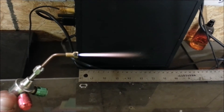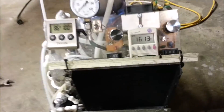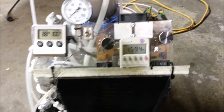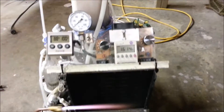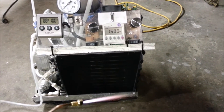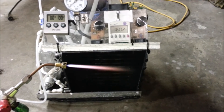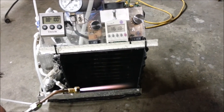We're at 15 amps and I've got a really nice turbo flame going here. For those keeping track of the numbers — I keep calling it amps because that's how I know I'm about to blow my fuse — that's 1,600 watts. This is the flame I'm getting, which is far different from the typical 2-foot-long, 5-liter-per-minute flame we're used to seeing. I'm really liking this.